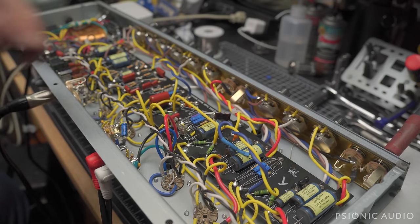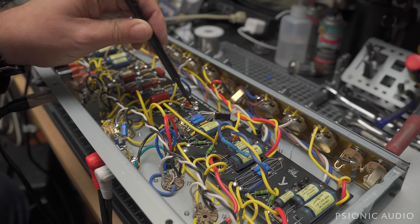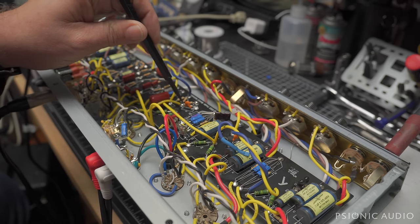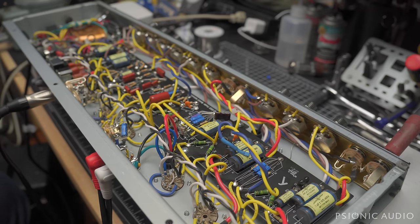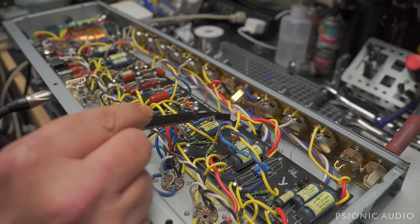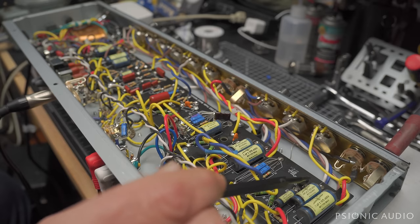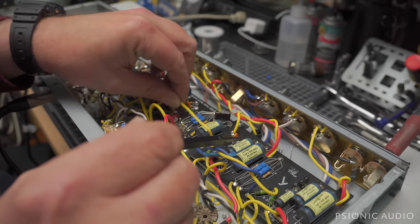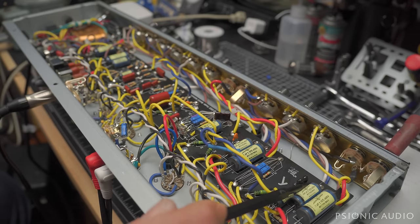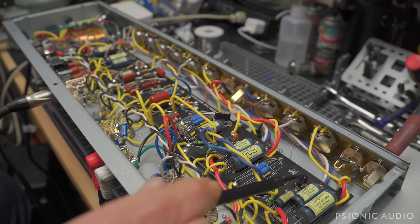The other thing: we had reverb feedback that was due to a bad 10-picofarad cap right here. I have changed that out — this is a Vishay 1-kilovolt 562-series cap, a very good quality cap — and there's no feedback with that in place. This Cornell Dubilier silver mica 500-picofarad cap is good and can stay. There was a generic SM-labeled 250-picofarad here and there's still one here; this one has been changed out for another Vishay 562 1-kilovolt. I only had the one so I put it where it's being used; the owner can have me change out the one on the currently unused normal channel if desired, but it may never fail.